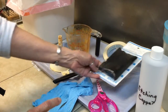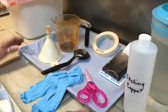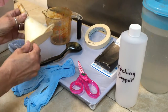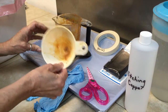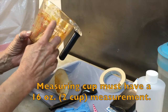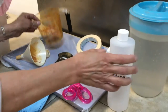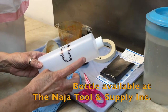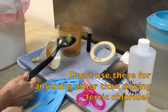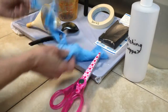So these are the things you're going to need to do the etching. You're going to need some kind of a tray — this is a plastic one with a trash bag on top — and you're going to use a funnel. I keep this one for ferric chloride. This is actually 20 ounces but the 16 ounces will be what fits in this bottle. You can get this bottle anywhere, but if you can't find it, Naja Tool and Supply has that too. You're going to need a plastic spoon that you're not going to use for anything else, and scissors and nitrile gloves.